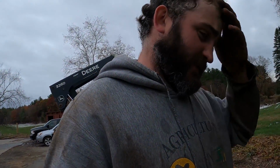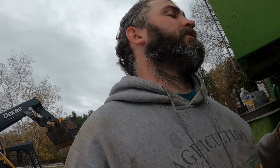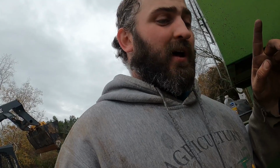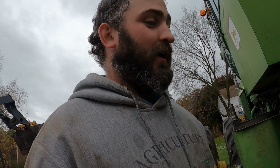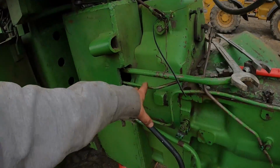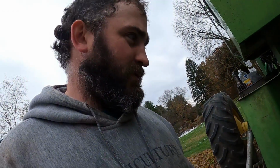So if you ever have a 7520 or you know somebody and they're splitting it, remind them, since I told Randy Griffin when I talked to him about purchasing the one that I got from him, I said, when you split it, there's 3 bolts. Otherwise it's a guessing game unless you have that knowledge. And there's like 6 bolts that go all the way through or go into the drop box here, but only 3 of them are used.